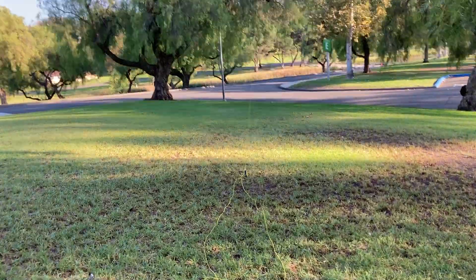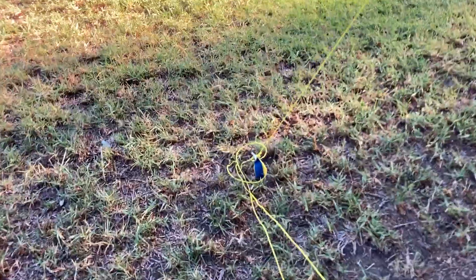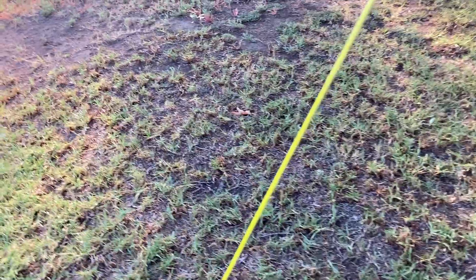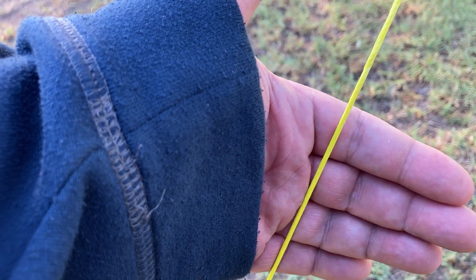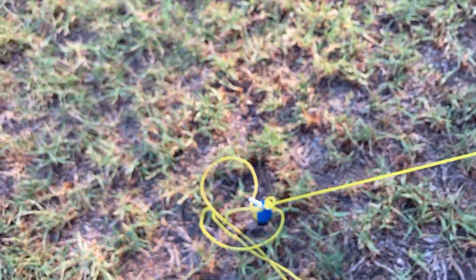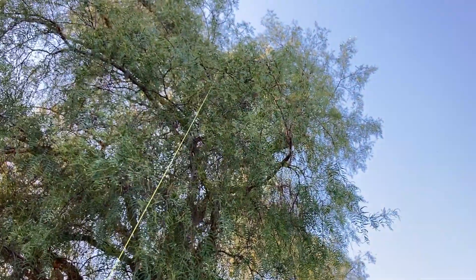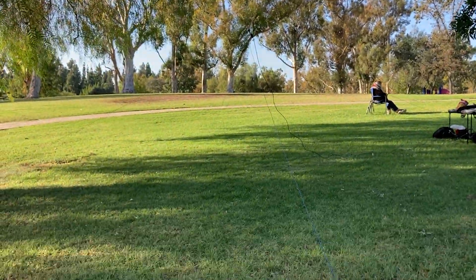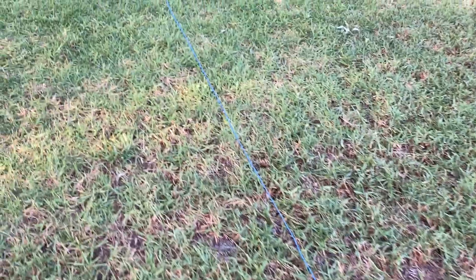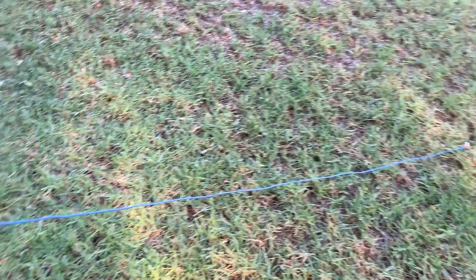The radiating element is also approximately sixteen and a half feet and half an inch. I have this weight — the kind used for trees — and the line is like a paracord, more for arborists. I throw the weight over the tree, tie it to one of those spikes, and that line goes all the way to the top. From there I lift up the antenna.